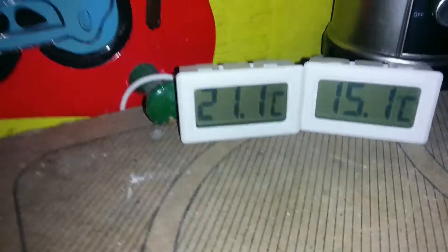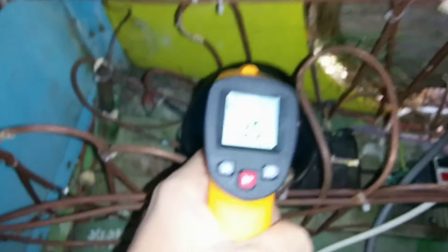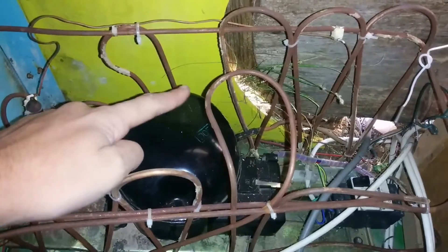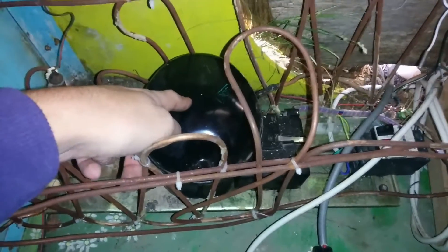It's not really insulated and yet it's heating up — 21.1 degrees — so I'm going to turn it off. Let's do a quick check on the compressor temperatures: 35 degrees, not really warm. The coils are at 31 degrees. I've been running it for really long periods, more than half an hour. Sometimes when the load is high — like when the ground outside has been heated by sunlight — it can trip the overload on the compressor. That needs to be fixed with a soft starter.